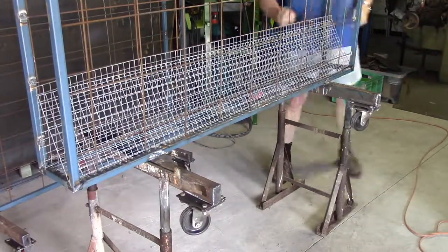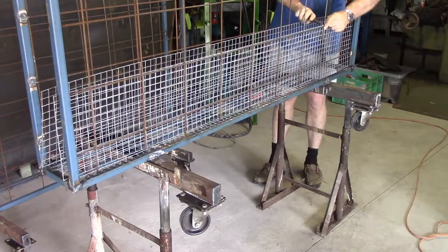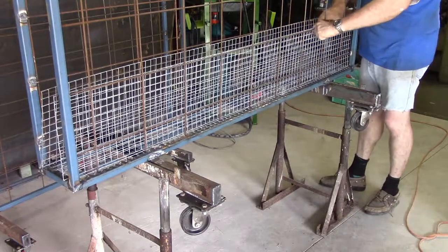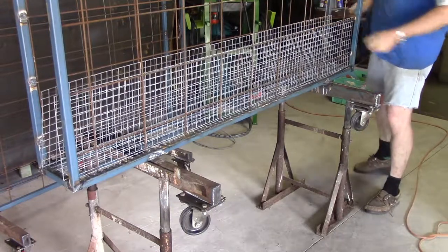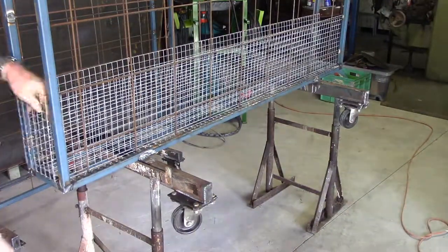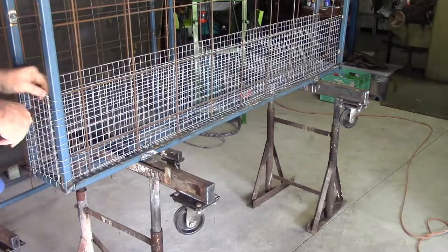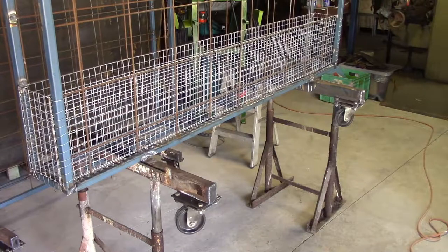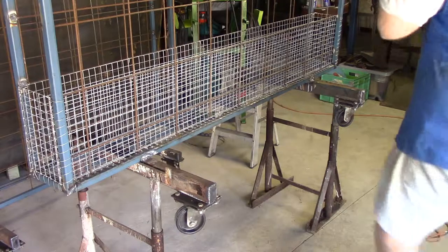I've fastened the small mesh onto the frame with stainless steel wire — that job is just tedious. Twist the wire up here, twist the wire up there. I think it's really important, once you've wrapped them, to make sure you bend them where they're out of the way and there's the least chance of someone getting hooked up on them. We won't bore you with the details of wiring all this up — suffice it to say it's a tedious and boring job that just has to be done. I did think of zip ties for this, but I rejected the idea because it's going to be out in the sun and plastic tends to go brittle after a while. But if anyone can think of something better that will last, by all means use it, because that job wasn't very pleasant.